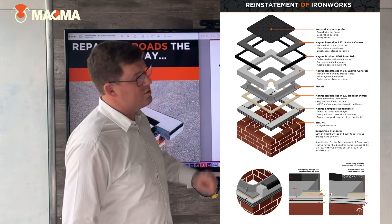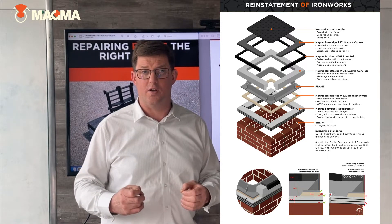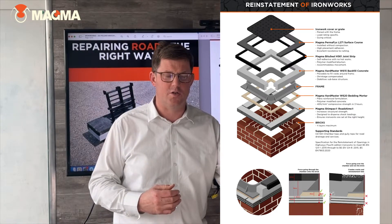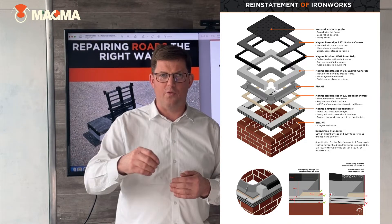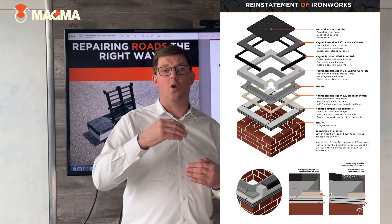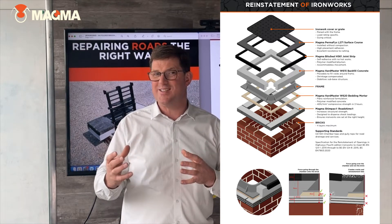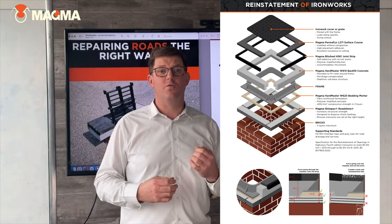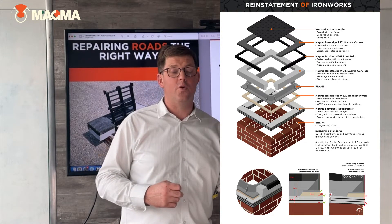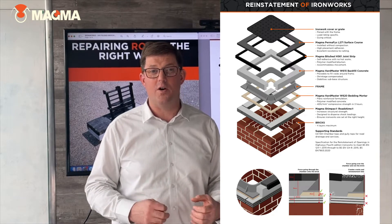The reason we've gone with this product is that whilst it has a very high compressive strength, it's also got very good tensile strength. Now where you've got ironwork in a high stress location — it could be on a roundabout, could be on a bend, could be coming up to a junction — where you have a lot of stress, sideways stress, forward and back stress, vehicles braking, vehicles accelerating, there is actually a lot of pressure and force on the ironwork which is more than just directly down. It's actually going across at an angle. Therefore you need a bedding mortar that has some tensile capacity. This material reaches 5 newtons per millimetre squared in tensile strength after the first three hours, then going on to full cure after 28 days at 12 newtons per millimetre squared, giving you that peace of mind that this ironwork is there to stay.